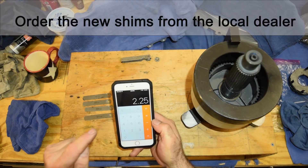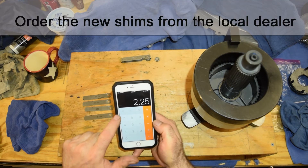So that comes out to 2.55. Now what we're going to do is average those. We take our 2.1 — we'll make it 4.2, plus our 2.55, and that comes out to 6.75, and then we'll divide that by 3. That gives us a shim of 2.25 millimeters.